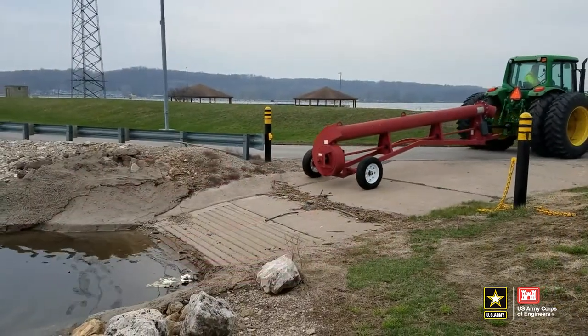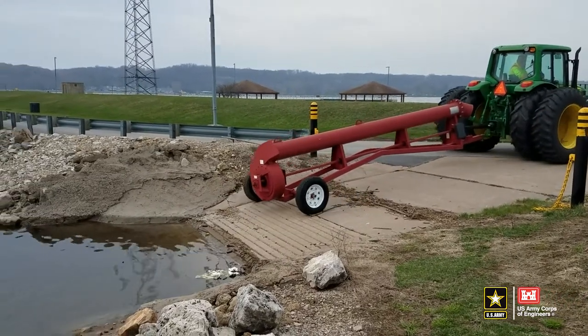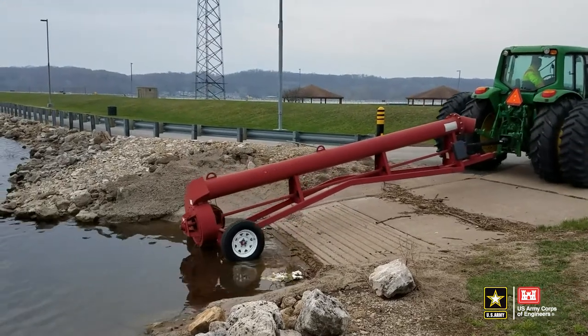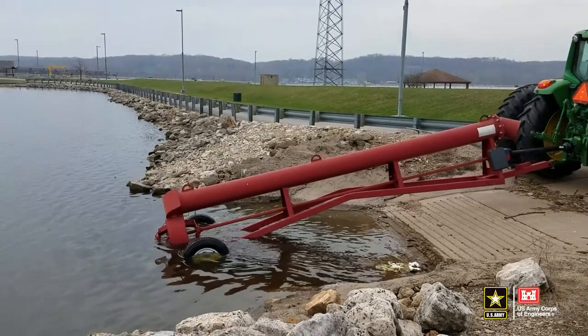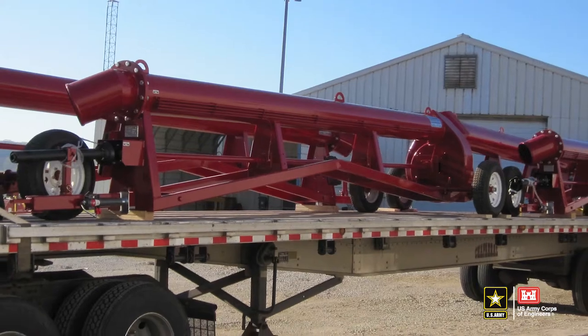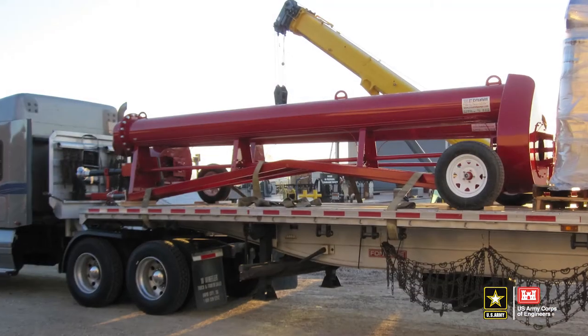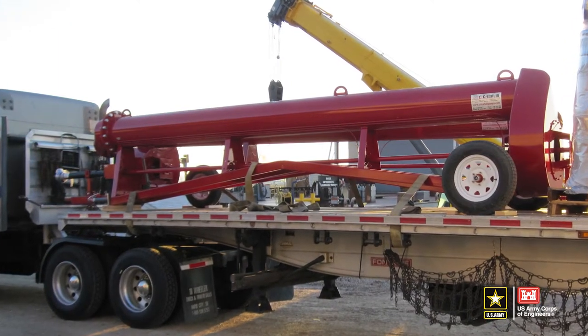Each 12 and 16-inch pump is housed on a trailer with a 3-inch pintle I-hitch. These trailers can be used for short distance movements and positioning of the pump, but not for long over-the-road transport and should never be used at highway speeds. A large secondary trailer with weight capacity of 2,000 pounds for the 12-inch pump and 2,200 pounds for the 16-inch pump is needed for long distance transportation.